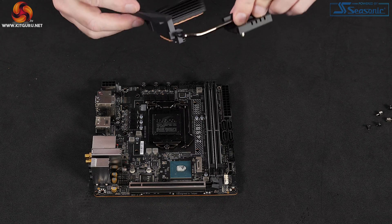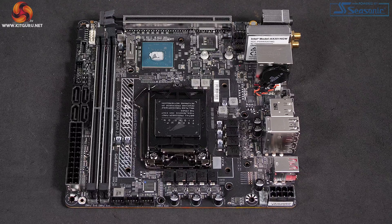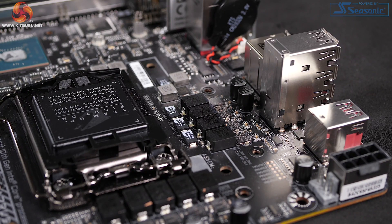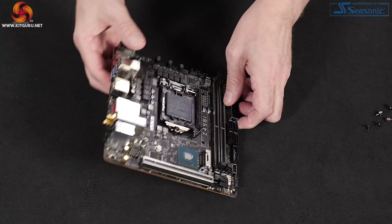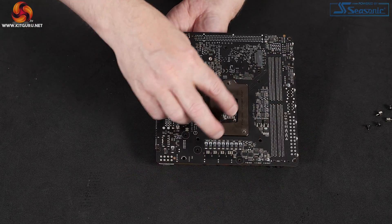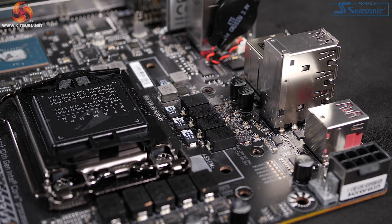In terms of bulk, however, perhaps a little lacking. Here we have the chipset and then we have the VRMs, and they are something to behold. The controller is an ISL 69269. The V-Core VRMs, eight phases, each rated at 90 amps. They are ISL 99390s. And of course we've got power that manages the system itself and the IGP because we have graphics output. The hardware scores highly on the Buildzoid scale as they are tantalum polymer capacitors.